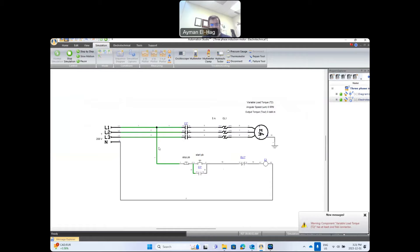When we run the simulation, you can see in green the power stops at the three-phase contactors, and in the control circuit it stops at the normally open auxiliary contactors. Now I'll click the start push button. Notice that when I click it, the power now has its way through the circuit and energizes relay C1. Once C1 is energized it closes the auxiliary contactors in parallel with the start button and closes the three contactors of the three-phase supply.